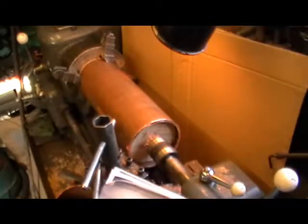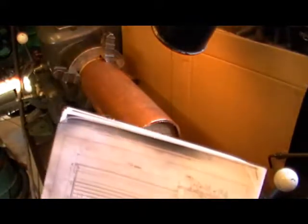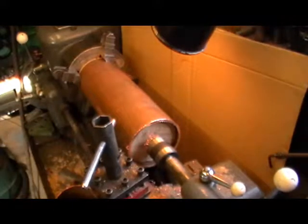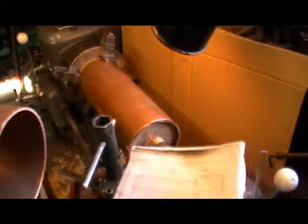So when I bought this material, I allowed approximately 3/16 or 5mm on the lengths, because obviously when they're rough sawn you can't guarantee they're going to be running true on the faces, and in my case that was a fact because this one was running quite a bit out. So as you can see, I've got the barrel in the lathe at the moment, and how I've gone about this is, well, I'll just show you the fire tube. That's my fire tube, 5 3/8. I've got that to do next, and I shall be doing that the same way I'm doing the barrel.